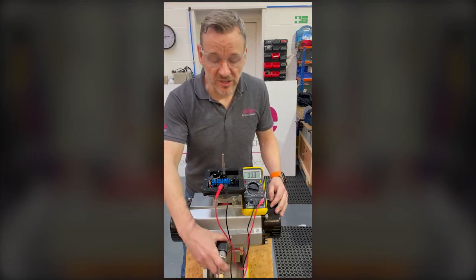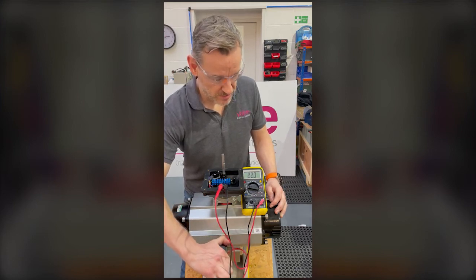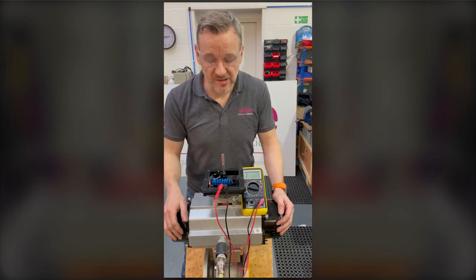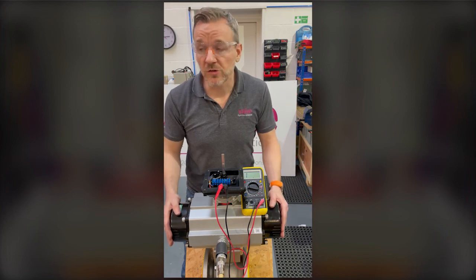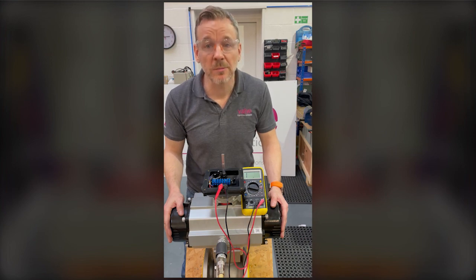The '1' disappears and I know that switch is set. If I de-energize the actuator, it changes again to show the state of the switch has changed, and I get the '1' back. So that's the top and bottom switch tested. I'll put the lid back on, fasten up all the screws, and this can go to the customer along with the other packages. Just a quick video to show how easy it is to set the switches in a Westlock limit switch box — thanks very much for watching.